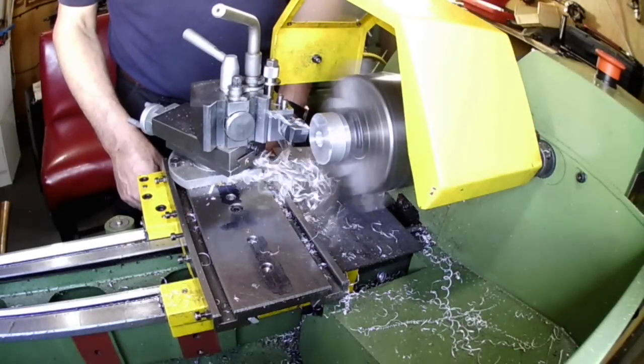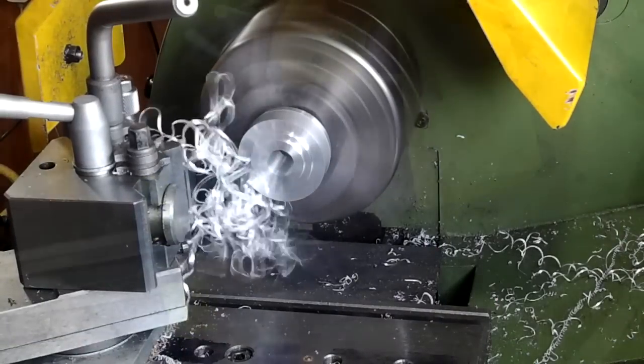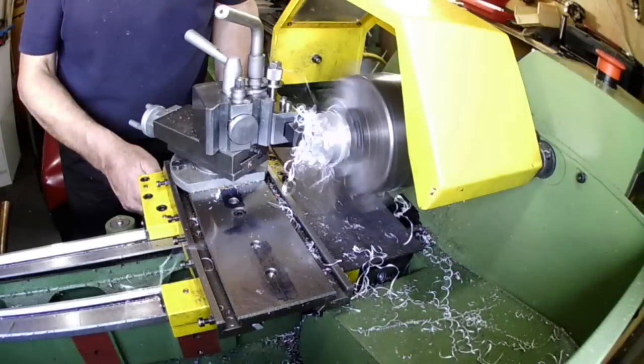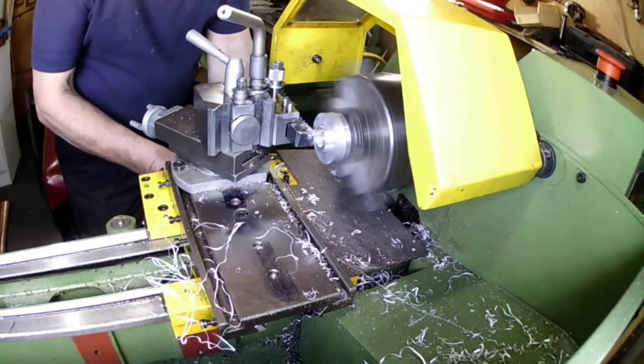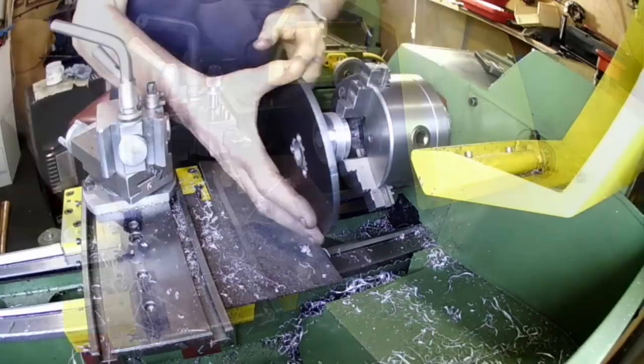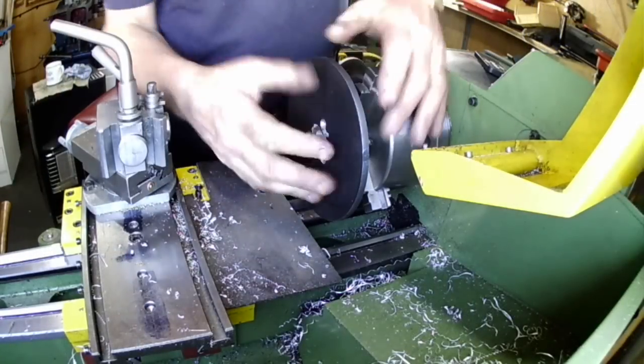On a 40mm PCD it also needs the 3 holes to coincide with the index plate. It needs a hole through the centre to accommodate the 16mm cap head screw, which has been pre-machined to fit into the back of the index table, allowing me to tighten everything together without interfering with any other work surfaces.